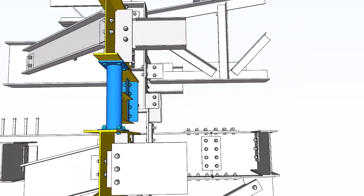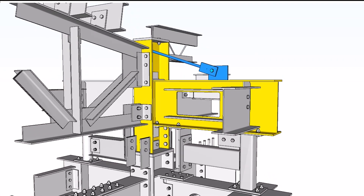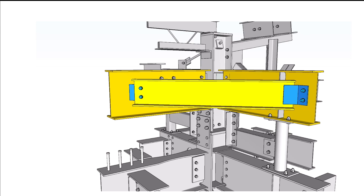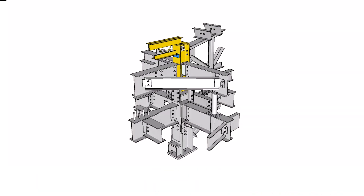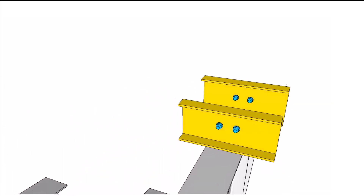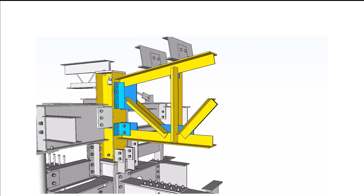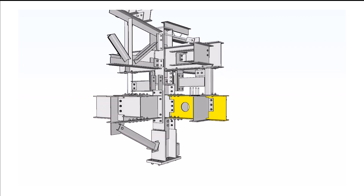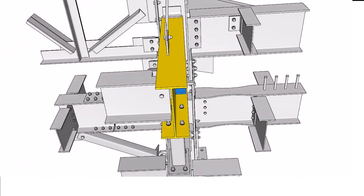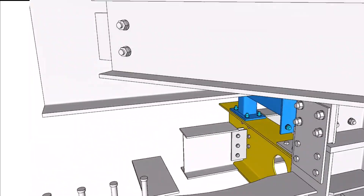Miscellaneous connections are specified for specific types of members such as roof joists or truss members. These include: clevis plate and rod connection (column supports girder with a number-three clevis and one-inch diameter rod); bolted-welded bent plate (the beam braces girders by a bolted-welded bent plate, field-bolted to the girder and shop-welded to the beam); welded joist; cold-formed Z-purlin; shear studs; truss connection; small circular web opening; larger web opening with stiffener plates; beam and column hanger connections; and HSS brace connection.